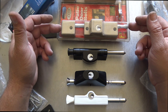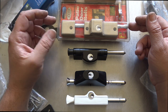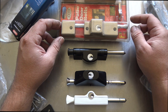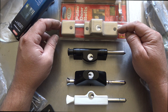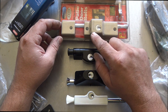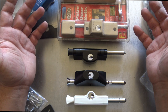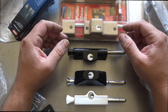During that time there was also the 680, which has been around for quite a long time. It wasn't the most friendly patio bolt — the keeper often went off skew, and after not being used they got hard and crusty. They were held on by one-way screws right down through the lock, which were a nightmare to remove. The cylinders themselves had very short cylinder housings, with not much room for the top pins, making them quite difficult to pick. If you came across one in the field you'd say it's going to be 20 minutes to get it off and rekeyed.